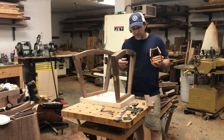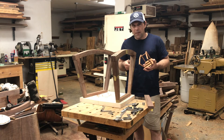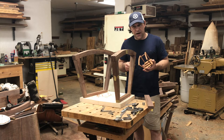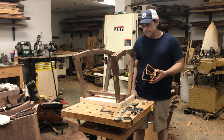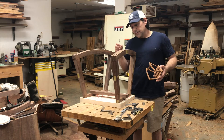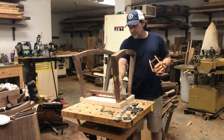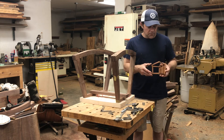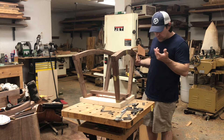What I'm kind of thinking for this is a mortise and tenon. And while I'm saying it — yeah, it's strong. It's probably my best option, so that's why I'm going to do it. Definitely not the simplest option. With a half lap I could really lay this piece on there, figure out where it's going, and mark it out — and you're done. For this mortise and tenon, I'm going to have to establish shoulders. It's going to be an angled mortise and an angled shoulder on the tenon piece. The mortise will be angled through this top rail — a little bit of difficulty in that, but nothing we can't handle.